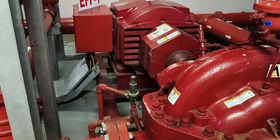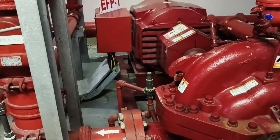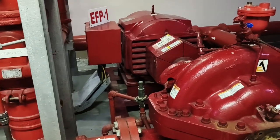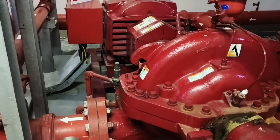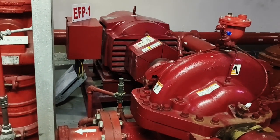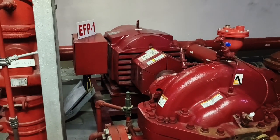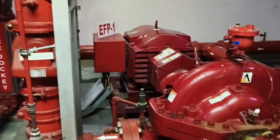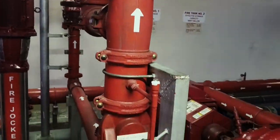The moment there is an actual fire and a sprinkler or hose reel is being used, the system will not reach that maximum pressure because water is flowing out. Pressure will not accumulate to the PRV set point, so the valve will hold. Even if it is discharging at 350 when only one hose reel nearby is in use, it can still relieve, providing safety protection for the system.